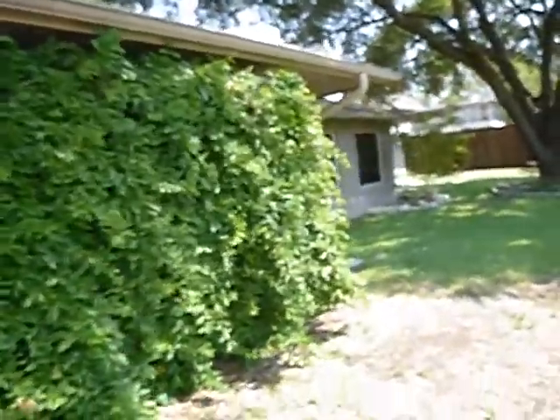Rain gutters going below grade — so far I haven't seen any that are different. You want termites? This is how you get them. There's a lot of debris and bushes right here — looks like a jungle. There's wood and wooden siding behind it. Fate loves temptation.